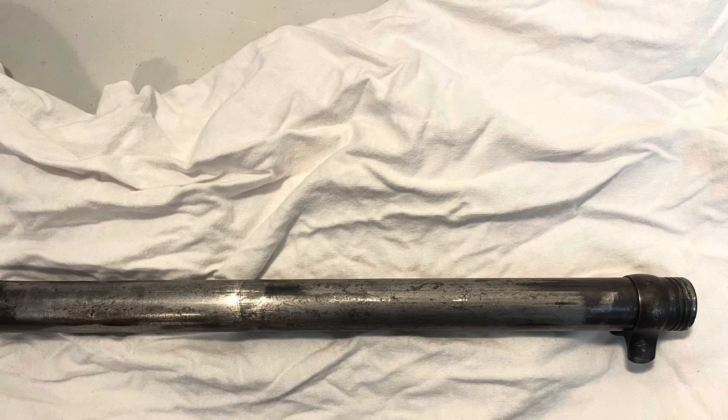You can see here that there's very little finish left on that magazine tube. I did a little bit of metalworking on this thing to straighten out the end of the magazine tube — it had a couple of dents and was kind of oval, so shells had problems going in. After doing some steel wool work, cleaning, and putting one coat of gun blue on, this is what the magazine tube looked like.